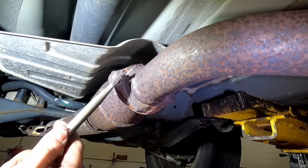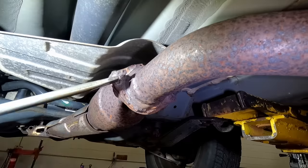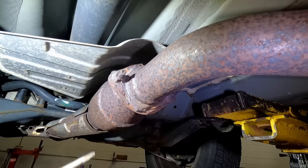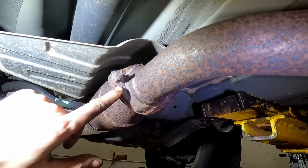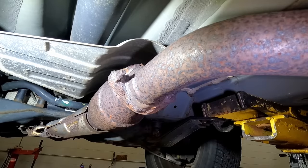I was coming in perpendicular to the part. Now I'm going to tip it so that as it's hitting, it's turning the nut in the direction of loosening. Two hits — it cracked it open and it spun the nut. Let me put the zoom lens back on so you can see what I'm talking about.